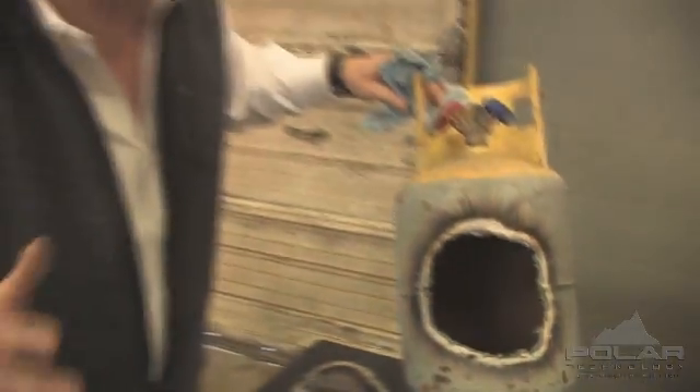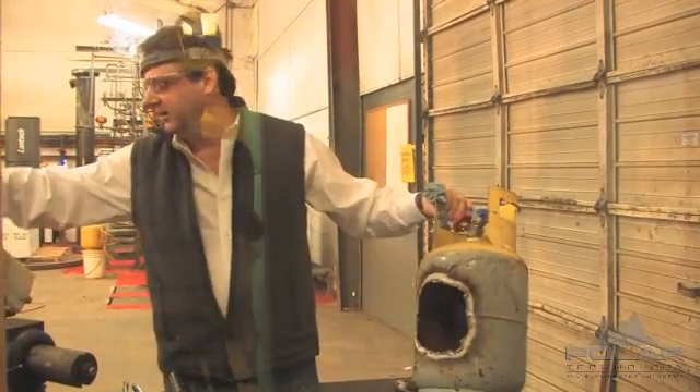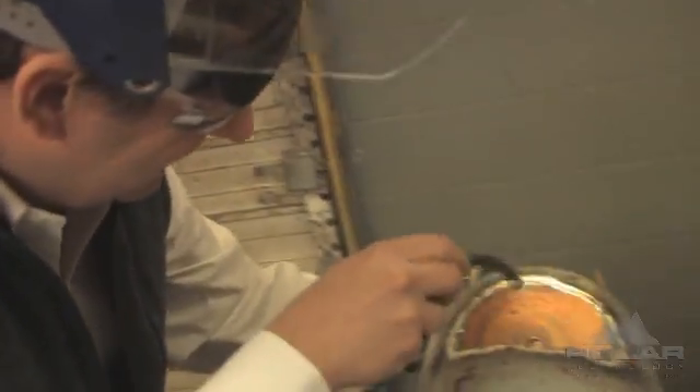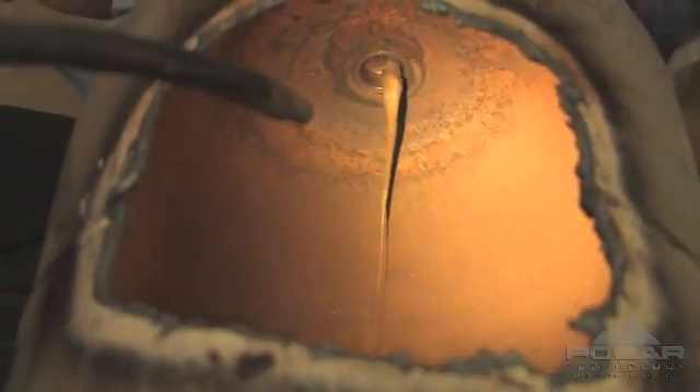Here's the inside of the tank. The first obvious problem with this tank: no dip tube. Take a look at that dip tube — see that little string of plastic back there? That's our dip tube. Not a whole lot going through that dip tube. Most of the metal corrosion you see in there is just the drippings from the side of the tank. Right there is our dip tube, and that's what's slowing down our tank from being able to get a good vacuum.